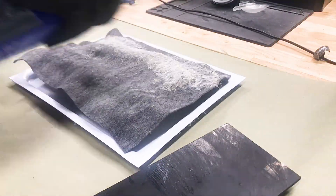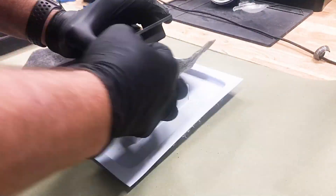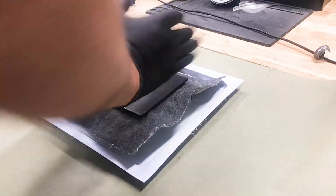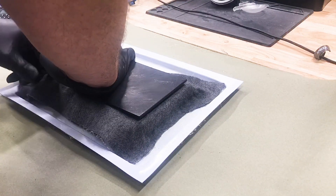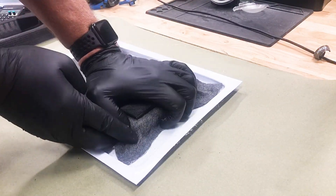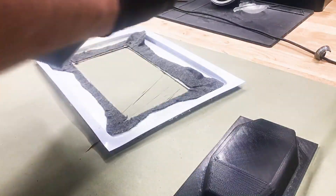To do that I'll first coat the back of the felt with Loctite contact cement, then lay the felt on the part. Using the felt applicator tool I depress the felt into the dual cavities of the part. I stretch the material to relax it to the fit and shape while continuing to apply driving pressure into the part. When fully seated I apply constant pressure to let the glue set up. Next I work the edges down the sides of the part, smoothing out the felt to avoid any folds. When finished I remove the applicator tool and cut the part from the sheet — with that the holder insert is complete.